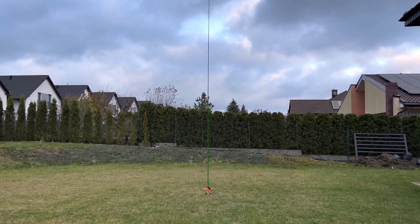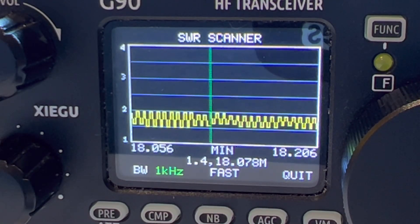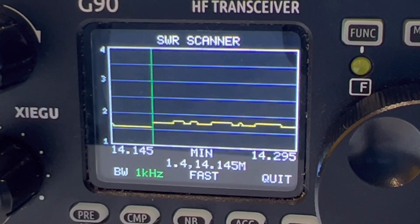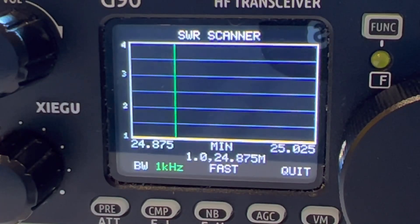We're going to go inside now. I'll check a little SWR and see if we can make some contacts. Checking SWR with my Xiegu G90. 40 meters was a little high but tunable, but when you get down to 17 and 20 it was in a pretty good range — you might not even need a tuner for these. When I got down to 10 and 12 meters I was pleasantly surprised at the amazing SWR I was getting with this antenna. This thing was going to be perfect for my Xiegu G90 — just use the ATU on the lower bands and for the higher bands not use it at all. I'm using 50 feet of coax up to a second floor window with my G90. This thing performed well on every band, struggled a little bit on 40, but I did make contacts all over Europe. I'm going to show you some 40, 20, and 15 meter contacts and then come back to talk about the 10 meter band where this thing really excelled.